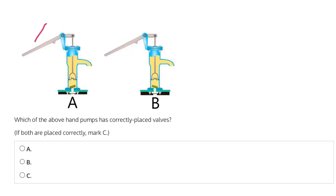On return of the lever — instead of bringing it up, we are now pushing it down — we see the opposite, where now the piston is moving upwards, and this bottom valve must be open, because this is where water is coming from. But you can't have the vacuum, the pressure conditions, in order to suck water from the ground with this top valve open. So, upon bringing the lever down and the piston up, we want this top valve closed and we want this bottom valve open.